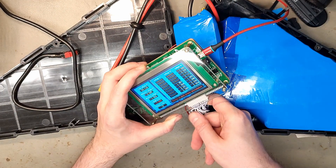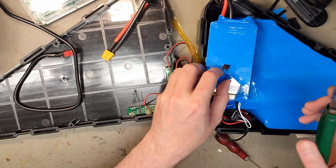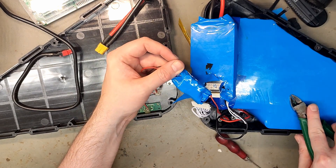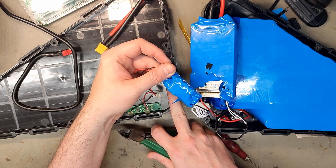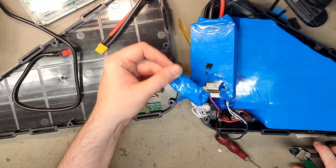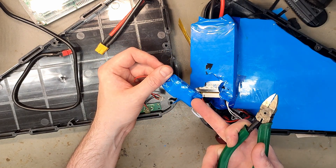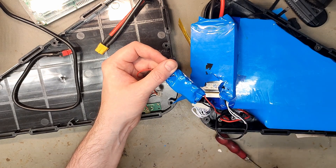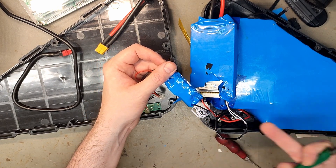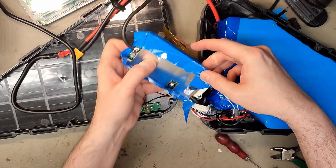Let's have a read on the BMS. This dead battery is probably because he hasn't used it in a while, or it could be the USB module. This one is constantly on, converting the full voltage of the battery pack to 5 volt USB, so it's always ready when you plug in a device. There's always a loss, so this draws power — maybe as much as 1 watt. If you leave the battery pack on, this will drain it eventually. Depending on the low voltage cutoff, these converters usually work in a range — for 14S, maybe down to 12S up to 16S before stopping. It definitely looks like a Bestway BMS, but with a Chinese label, not a commercial label.